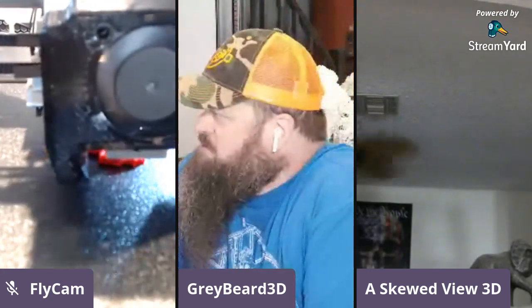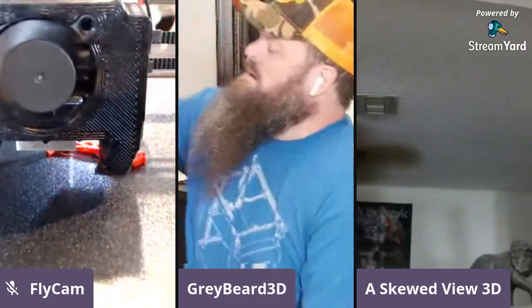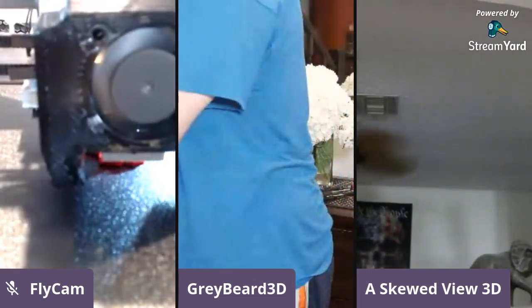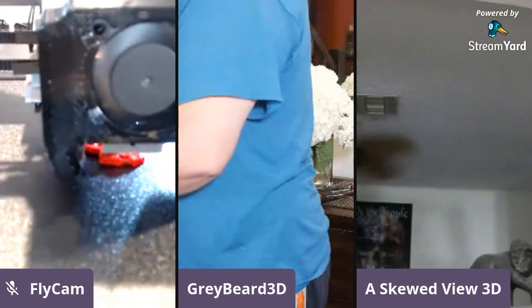So this isn't bad. I mean, it's not great. We have some problems with the bed. Well, I have a speed problem. Mostly I'm new to Duet, so trying to figure out how to make this Duet go the actual speed I'm telling it to move is interesting. I hear a clicking. It reminds me of an extruder click. I think it's a friction problem.